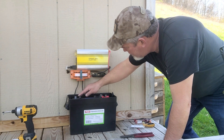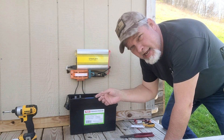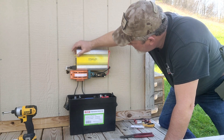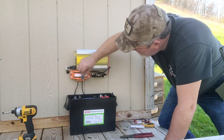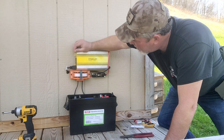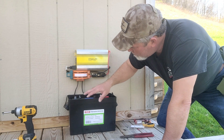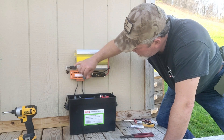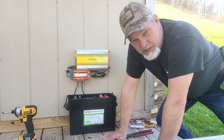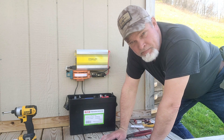Okay, so now I've got my switch hooked up, battery hooked up to the switch, and the switch to the inverter. I pull it over this way, push that down — that's going to allow me to power up my inverter, and it does power up. I'll go ahead and shut that off. When I take it off there's a little power left in it. Now I'm going to hook up my solar panel to this side, run my wire down out to the panel. When I want to charge it, I'm done using this — I can just flip this over and leave it like that till next weekend or the next video. It's a beautiful sunny day so I'm going to get to digging the hole and get the post in the ground.